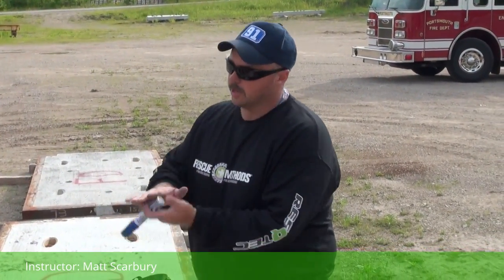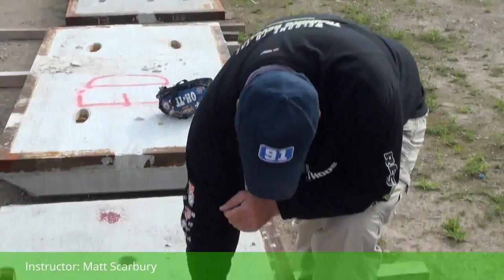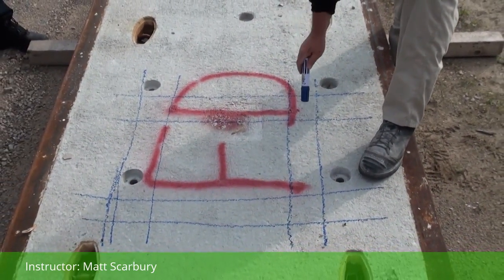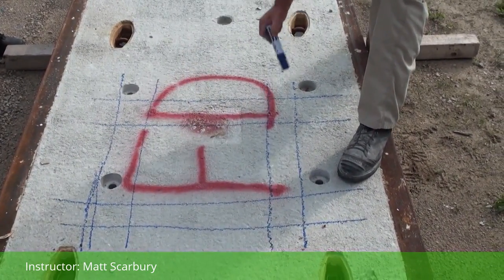Here's the problem we're going to run into: we have a great big thick piece of concrete. The concrete is thicker than the depth that our saw will cut, so we have to do what's called a step cut. To do this, we're going to cut these lines every single one of them, then take our jackhammers and chisel out the whole trough that we cut.